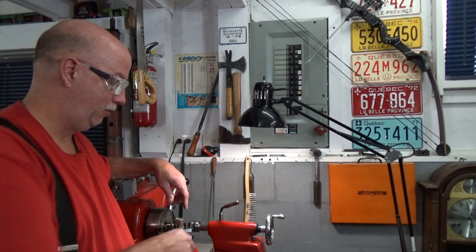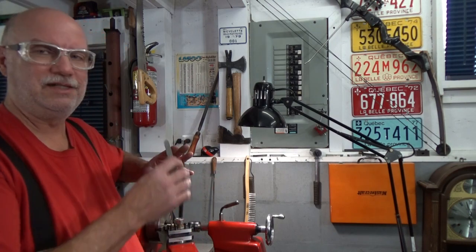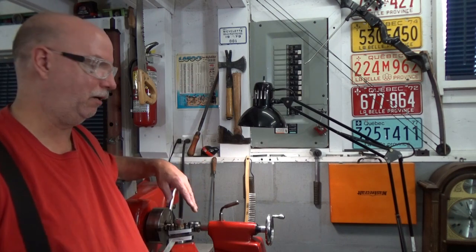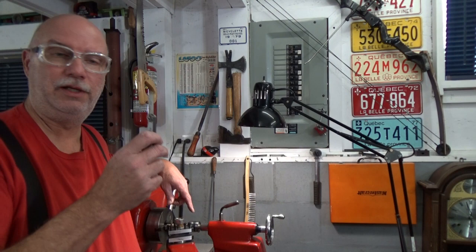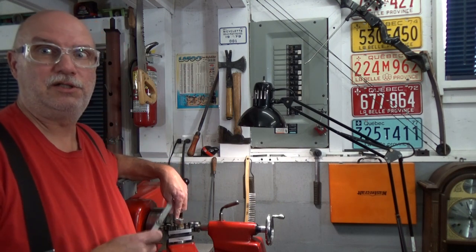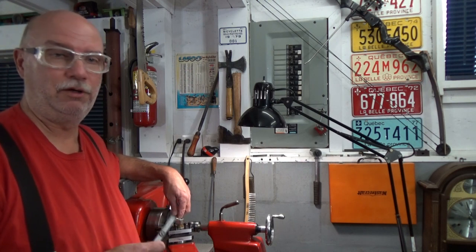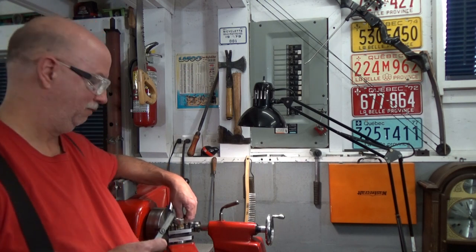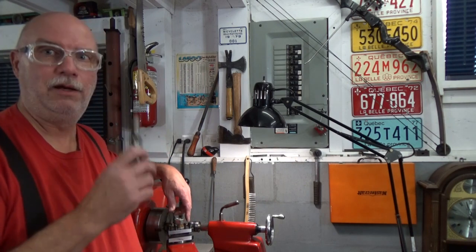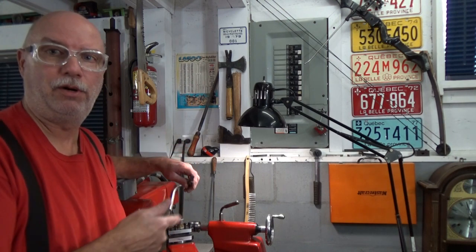So what are we going to do? Well, we're going to come and position our cutting tool, which has a very small tool nose radius and is quite sharp. So we're going to come and position it to 10/1000ths of an inch from the high spot, somewhere on this ball, somewhere that has a good dimensional surface, so not where the nub is. We're going to be using a 10/1000ths of an inch shim stock for that. Remember, off the high spot. And we don't want backlash to be a problem here.